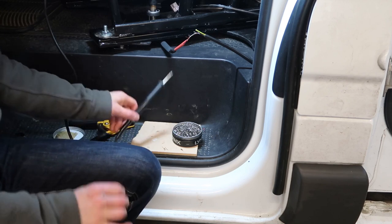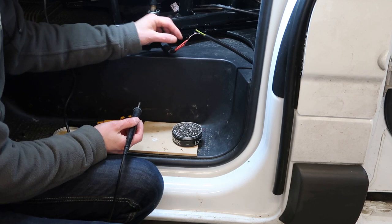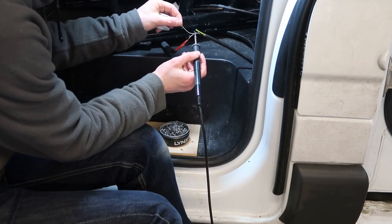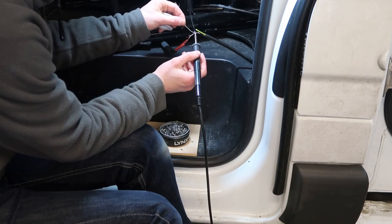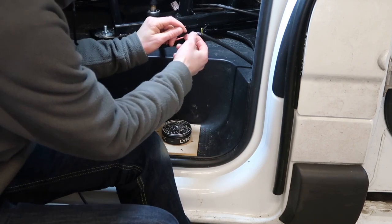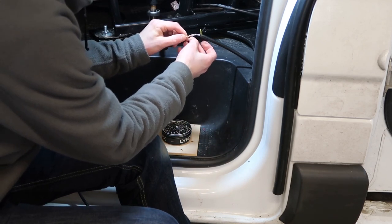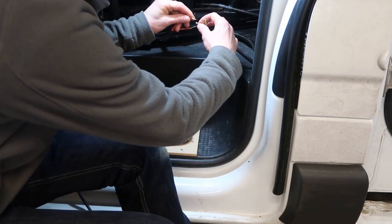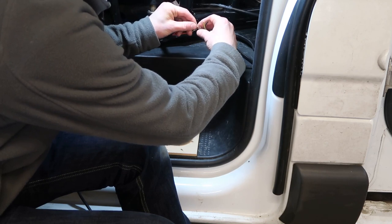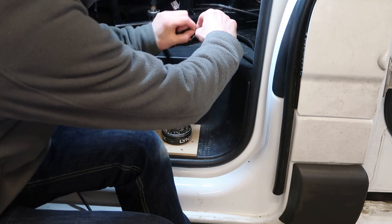The process is now exactly the same on the other side of the wire. I have the heat shrink already on the harness wire — hold it against the wire until the wires are hot, then add solder from the far side. I think I've got the colours the right way around, but it probably doesn't really matter, because these wires carry no current or voltage most of the time, and when they fire all they're doing is providing a voltage for the pyrotechnic charge to fire.